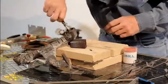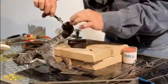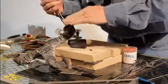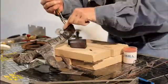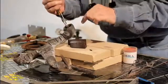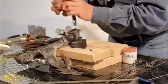Now when you get through, guys love this part of it — you can grind it down, there's no discoloration, you can drill it, tap it, and machine it. You can't do that with all those special rods out there. Once you grind it down, get some 60-grit sandpaper, lay right up against it, take a little hammer and just peen that sandpaper — it puts the grain structure back in. You can't even tell where you welded. Guys, it doesn't take but about one or two little cast iron repairs to pay for that torch. You can also pick up some nice extra bucks on the side doing that.